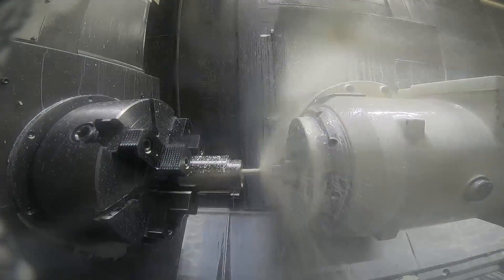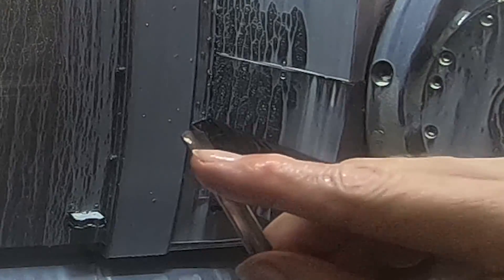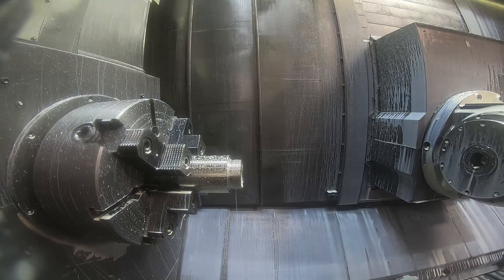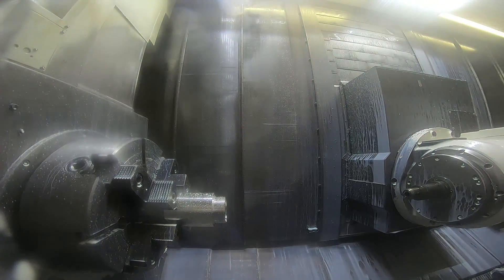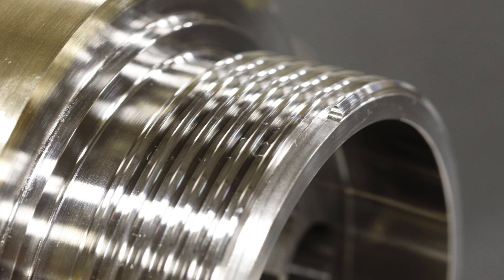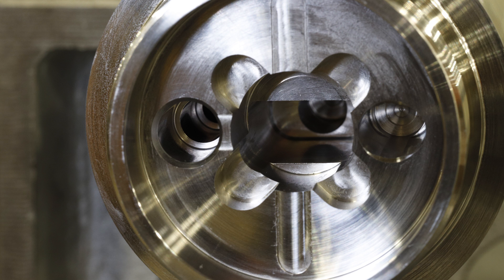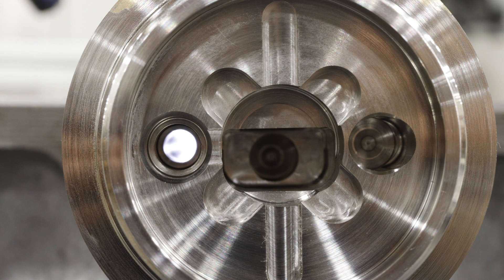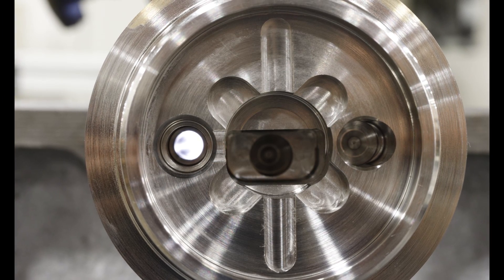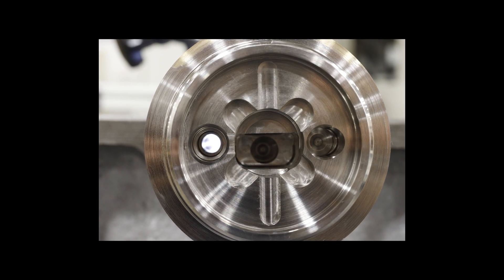I think this is the final one here. So that's the part — sometimes those drills chip like that and you have to grind all the way back beyond that chip. So here's a few images of the finished operation on the part. That's the thread blunt start close up. That's the corner that we machined with the 5-axis movements. And the two holes that have the close tolerance form tools. And the 18.8 inch deep 5/16ths hole — I put a light at the end of it so you could see down the hole. So thanks for watching, and to all those for whom this is the first time you've seen one of my videos, please subscribe.